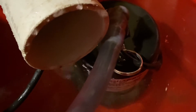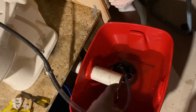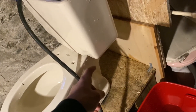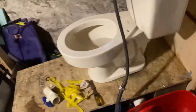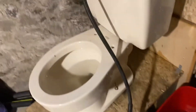Notice how you can hear that siphon breaking in the pipe. Now if this was connected to an actual drain system, this would be siphoning — like a lot. That noise you heard was makeup air going in the pipe, satisfying the low pressure end, or the vacuum end of the trapway. I'll explain it later, because I will be doing videos on actual drainage systems, because I'm AMB Plumbing — not just toilets.